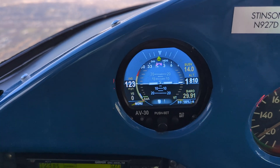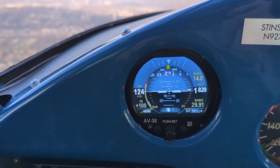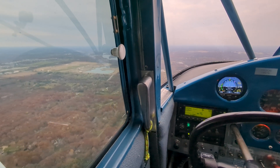With this Lycoming, I was playing a different game. I might not be breaking any land speed records, but I'm seeing numbers on the airspeed indicator that are higher than with the Franklin — maybe five or six miles per hour when the propeller is pitched for cruise. But I'm burning one to one and a half gallons fewer per hour. This changes the range from just under 350 miles to a little over 400 miles with 30 minutes reserve.